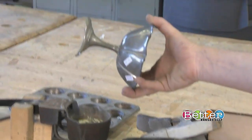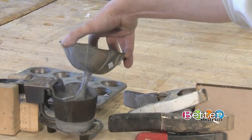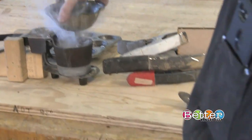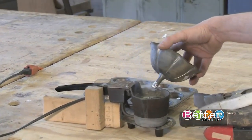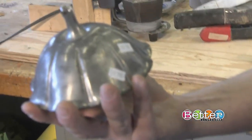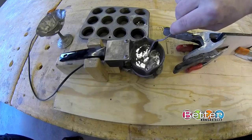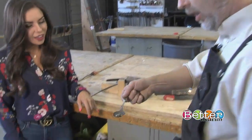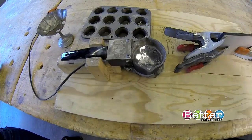In very short order, look — all melted away. Dave actually told me this is 400 degrees, maybe even a little bit hotter, and that's why he's doing all the heavy lifting right now. Things are actually bubbling there. What's going on? Well, there may be a little wax and a little residue, some entrapped air under the bottom of this part, so that heats up and bubbles a little bit. But we've melted away the bottom of our part and now we have a full pot of metal to make our cast with. Do some skimming of the dross at the top — dross is the residue that is formed when you mix metal with the corrosive oxygen atmosphere of our planet.